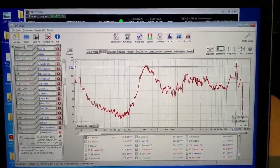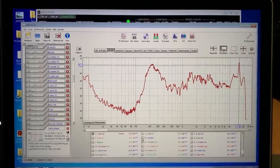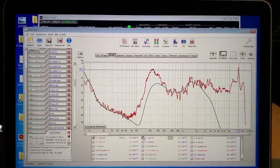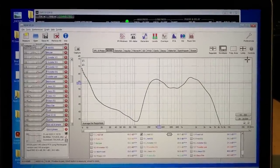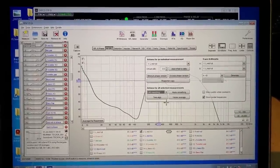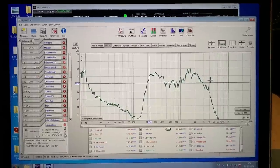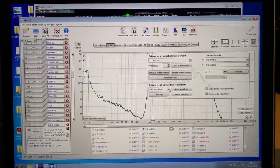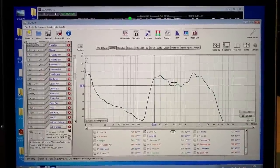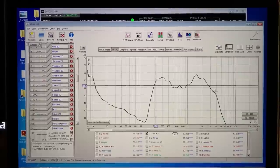The breakup point is quite characteristic for wide-bands — it gives the illusion of really nice top end because it's doing tweeter work there. But we're not using it full-range. I'd recommend at least 1/6th of an octave smoothing rather than 1/48th of an octave, because 1/48th shows too much information and you'd need 50 EQ bands to perfect it. With 1/6th smoothing you see the major problem areas, the major peaks, and can make it linear. Even on the crossover slope I can see a peak.